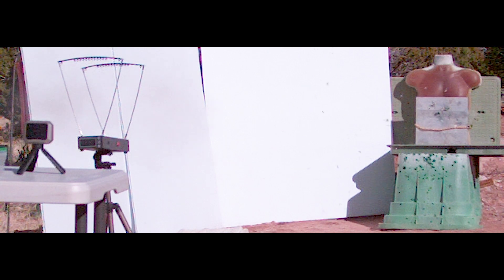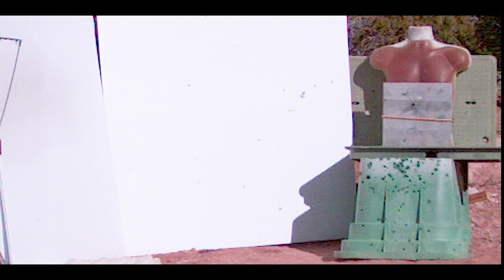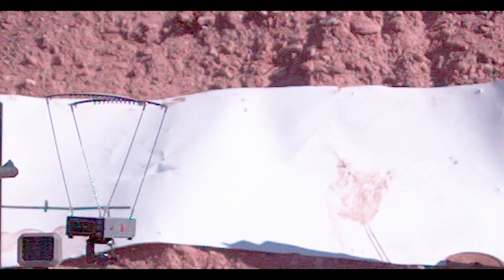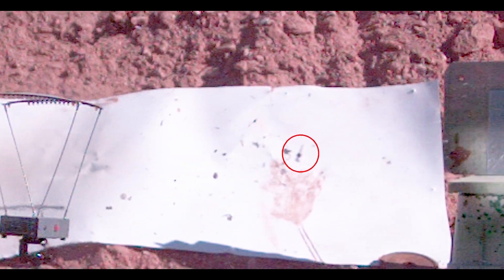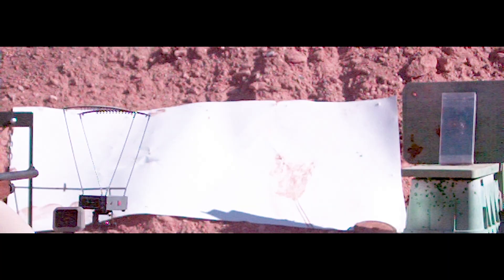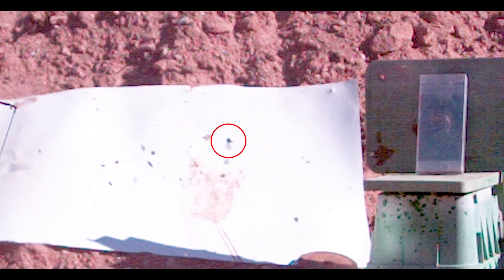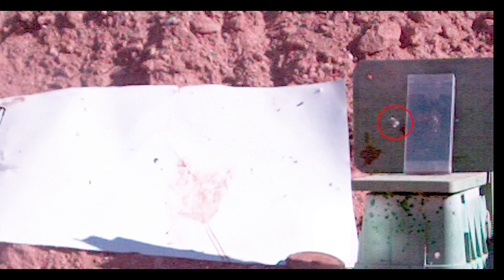Many different designs later, we started to figure it out slowly but surely. We were starting to get the projectiles to self-stabilize and self-correct, even when the sabot would fall apart all around the projectile. Once we saw the consistency of the stabilization and self-correcting, we decided to work more on accuracy. To achieve this, all we did was lower the velocity by about 200 feet per second, and we had a projectile that was flying a little bit more straight and on target. So the last thing to work on is the discarding sabots — let's head out to the range.